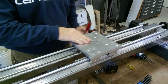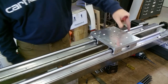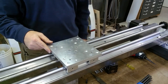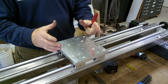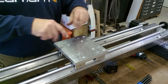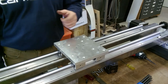I think I've got them exactly backwards still — they need to be a little bit further apart. The rattle you hear is because these are inexpensive bearings and I haven't adjusted the lash yet — that's what these screws are for. But the bottom line is: if you do something like this, go to screw it on, and your holes don't line up, take a look at the bearings. The holes are not in the right spot. Fiddle around, turn them back and forth, and you'll get it. Then you'll go back to saying saving a few bucks was still worth it. Good luck guys.